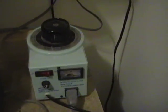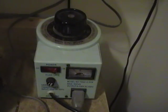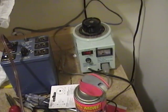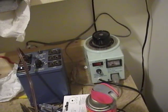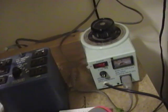This variac came with a 5 amp fuse; I've replaced it with a 1 amp fuse. When I work on radios like this they don't draw that much current, and since there is no fuse on this radio, that should offer some protection if something is wrong. Variac all the way down — here goes.